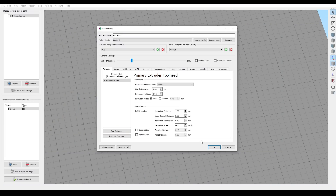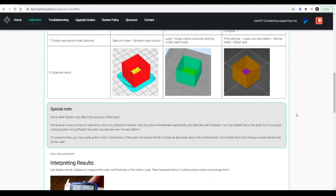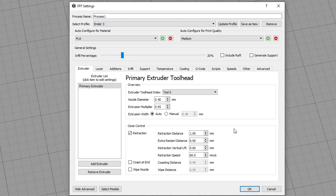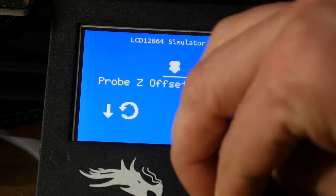There's nothing in the slicer that needs to be changed other than retraction settings, which brings us on to calibration. Also linked in the description is a free calibration website where you should PID auto-tune the new hot end, double check the extruder E-step value, and if you like, fine-tune the flow rate for your slicer. You can also use the form to generate a retraction tower — I settled on a final value of 1mm retraction at 60mm per second.